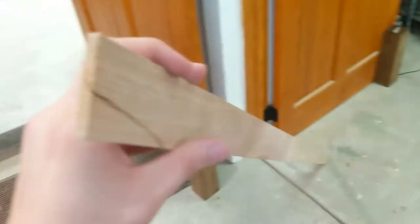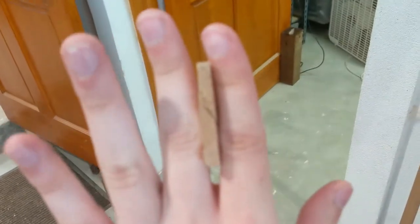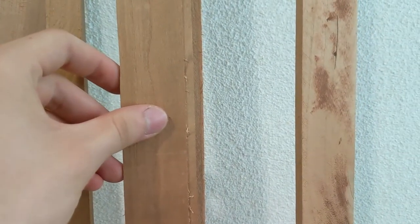Among this mess of cuts, we made a whole bunch of different ribs. The initial piece I was considering is obviously too thick, but more importantly the grain just isn't right. We don't want the grain running like that - we want it running as parallel to the long sides as possible, so we don't want to see many of the annual rings. Pardon that motorcycle - this piece here is what we're looking for.